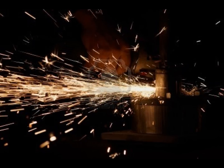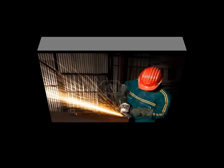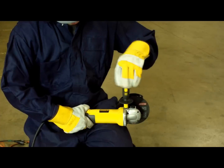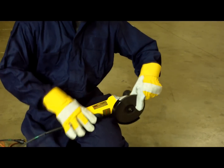Due to its design for grinding, an angle grinder should not be used as a cutting tool where a safer alternative is available or can be obtained. Always pay attention to the spark trail as they can be extremely dangerous. When using an angle grinder that can switch between left-handed and right-handed operation, remember to move the blade guard when you move the handle.